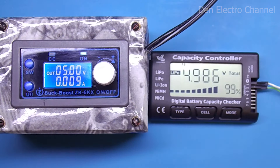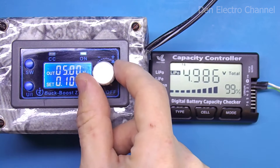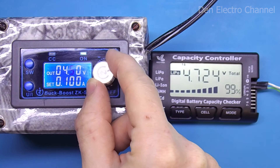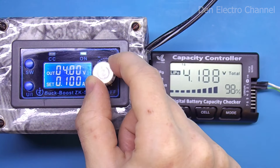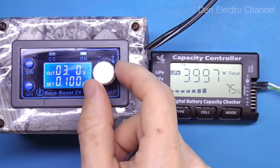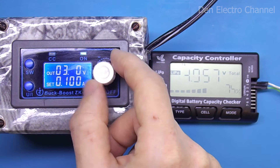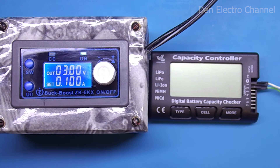When powered by only one battery, the multimeter performs very poorly — it is essentially not intended for this. Voltages up to 4 volts show approximately correctly, but below that the measurements are greatly distorted. The multimeter shows an image up to about 3 volts, but the measurements are no longer correct. Therefore, the battery should not be left connected in this state, otherwise it may be completely discharged.